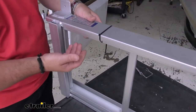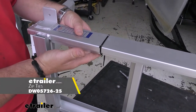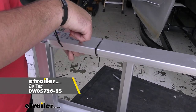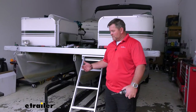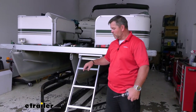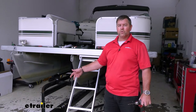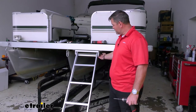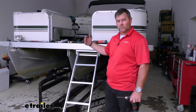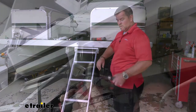What I did is I took the ladder, pushed it all the way back, pulled it all the way up, and then you can run string around anything that's going to hold it up tight. Now we're going to drill a hole through the side and then through the ladder. Since we're installing this out of the water on the trailer, we did have to move the trailer ladder — it's usually just attached by two or three U-bolts. Remove those, set your ladder off to the side, because the ladder we're mounting has to be extended out in order to drill the holes. Now we hung it up by clamping it to the cross members.